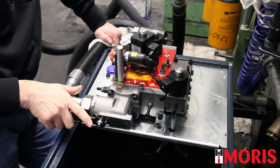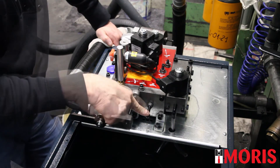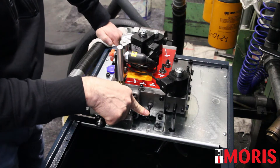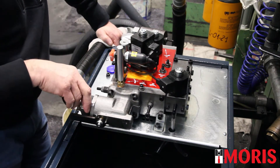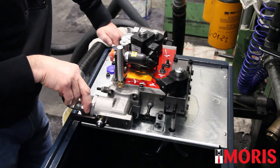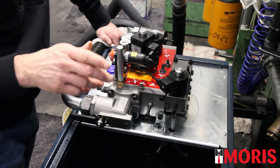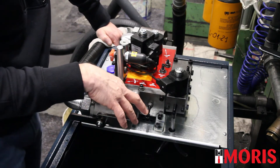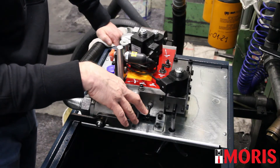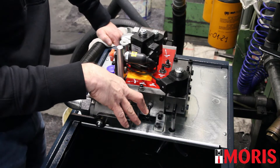Repair sequence R6A: verification of screw number 8. Screw number 8 is preset in factory based on the minimum static pressure. For example, if the communicated minimum static pressure is 20 bar, regulation number 8 must be set at 18 bars, that is 2 bar less than the minimum static pressure.